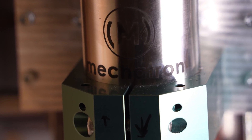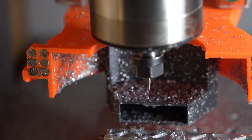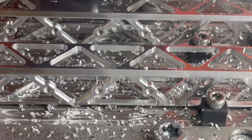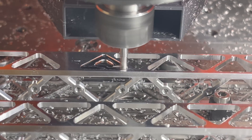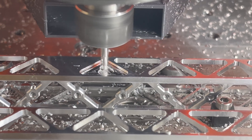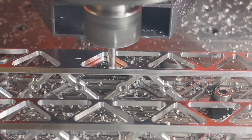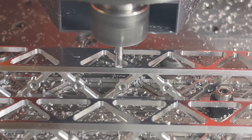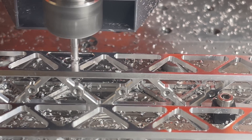About machining — it took me a few days to come up with the process to hold and mill this X-beam. I mill it on a modded Nomad 883 from Carbide 3D. I would not suggest anyone doing it on such a machine; it is a huge pain, even with the modded one. 50% of the time was invested to come up with workarounds for the quirks of my machine. It takes about two hours for every X-beam to be machined, including manual tool changes and flipping the parts.